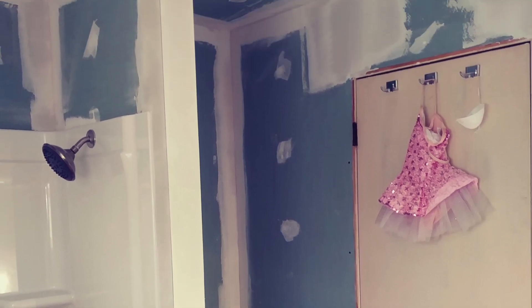This is the bathroom I showed you last week on Maintenance Monday — I finished it but didn't have the sanding done yet when I put up the video. I'm showing you now how it looks sanded. We started with the drywall torn out, put on the green board which is water resistant and mold resistant, especially in a bathroom like this that seems to steam up quite a bit. I sanded it down and they're going to paint and prime it themselves, but I just want to show you how it looks all sanded and ready to go for paint.